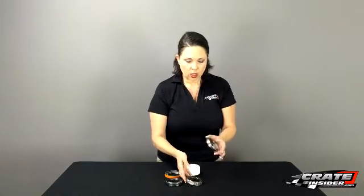How that process works is that the item is exposed to a chemical, and this chemical reaction puts a 1-micron film all over the entire item. Then that piece is put into what's called a vibratory bowl. It vibrates with ceramic, and that knocks off the peaks — because that micron film is in the peaks and in the valleys — so it knocks off the peaks. Then that film reforms, more peaks are knocked off, until you have a completely smooth surface.